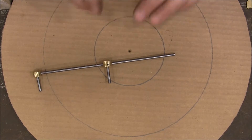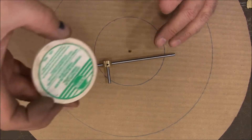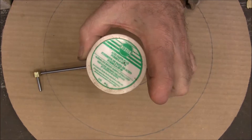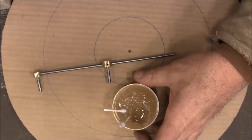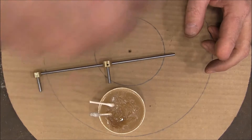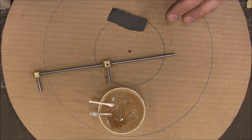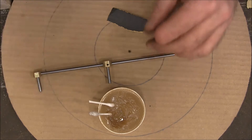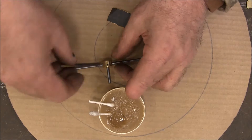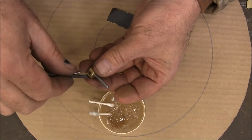I'm starting to get my parts cleaned up. I've got them all made, and I'm starting to get them cleaned up to be soldered. I'm using some acid paste flux right there, just using some Q-tips. I'm using the stick-in to get inside the little holes and on the outside of the parts. I'm going to take a little piece of sandpaper, roll it up, and stick it in the holes right here to clean those up.